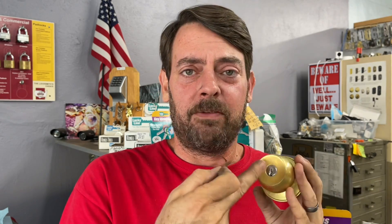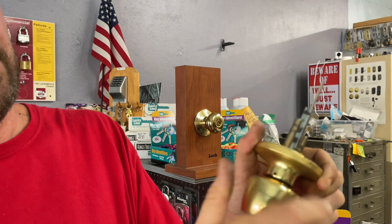When you have something like a Defiant or Gatehouse in the locked position, the retainer — the pin that holds the knob on — it won't press in. That's obviously for a good reason: when it's locked you can't push and pull it off. So even if you pick it to the locked position the retainer won't depress, and some of them you have to turn the knob, which requires the unlocked position. On all of those, yes, you do have to spin the lock. However, that brings us to Schlage.